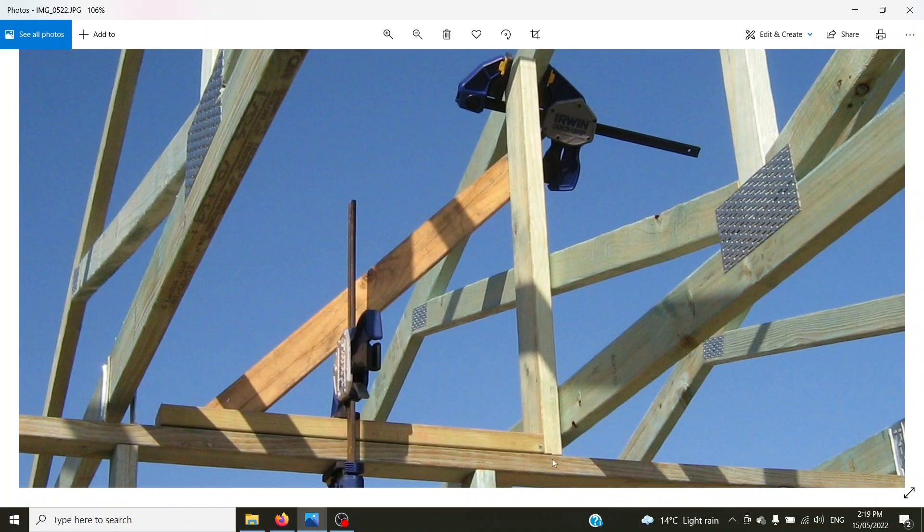This little bracket is a fantastic little system — an easy way to get your trusses vertical without mucking around too much. Just clamp on there, get your right distance, throw your truss up, put a clamp on the top, then get your ends measured and fasten both ends. Now if you don't have a wall frame here to fasten on, you can actually make a rectangular frame that sits in between. You have to be a little bit careful because the bottom cord is going to scoot backwards and tip the frame over.